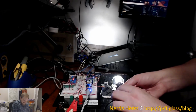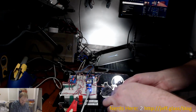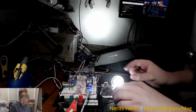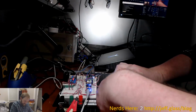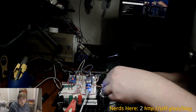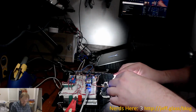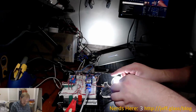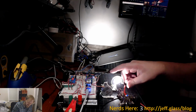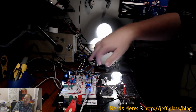I think the other thing that I'm learning from this experimentation is that adding optical elements that aren't pre-made lenses to existing LEDs means that the precision with which all of this would need to be placed increases significantly, right? There's a fair amount about the current light that's very forgiving, in the sense that the optical element is what it is, and it just sits within the body. So if some part of it is off by a couple of degrees, who's ever going to know? Who's ever going to see? The light is the light. But with this, now we have two optical elements, and they're moving in relation to each other. And that makes everything just that much more critical.